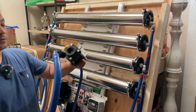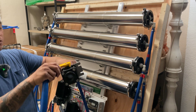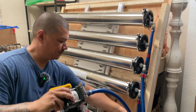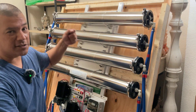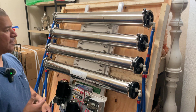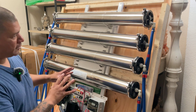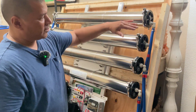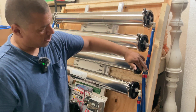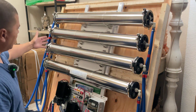Same thing with the opposite elbow — whatever position you leave it in, make sure it's not in the way so the hose doesn't interfere when you open your valve. That's step number two. Step number one is mounting the system to your wall inside your van, ladder rack, or trailer — you'll probably have to do some small modifications to fit your needs. Everything is built to modify. All the hoses are already pre-plumbed: your RO inlet, carbon inlet, DI inlet, and the hoses on the left side are your outlets.